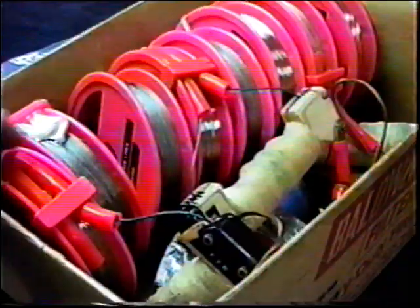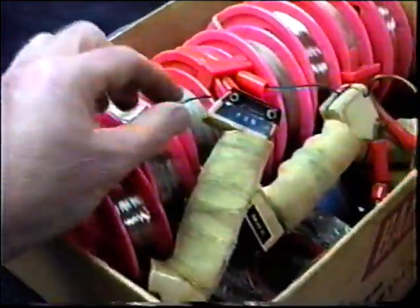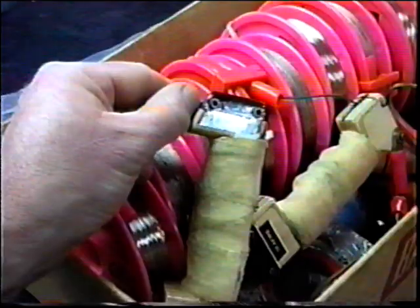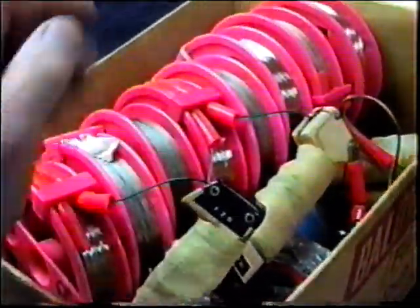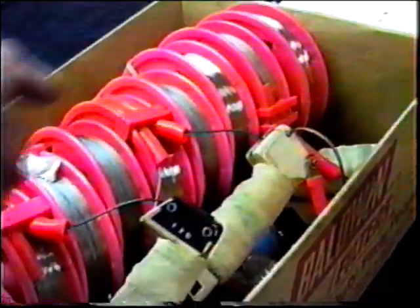Another thing I'm going to do later today, I'm just going to make a good suggestion. At the beginning of every season, I replace all the handle cables. If a handle is adjusted for one plane, it wears at one spot constantly. And it's the cheapest insurance in the world to replace the handle cable and crimps at the beginning of every season. On all my handles, I sit down and in 15 minutes, I have all of these replaced.